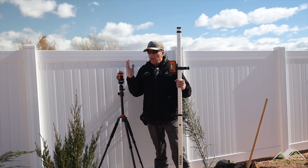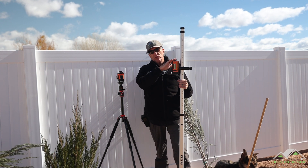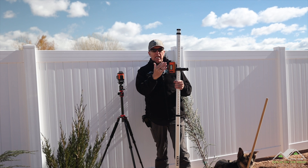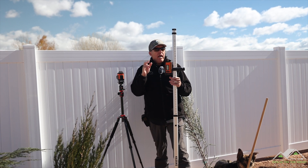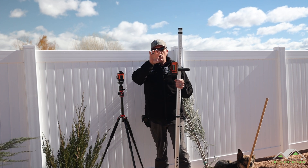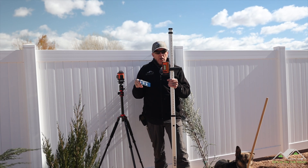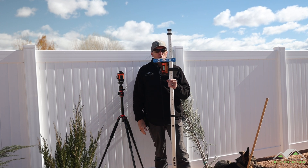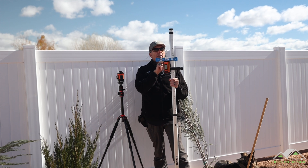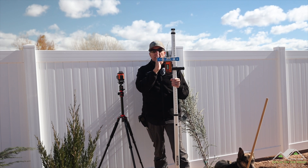It's not the optimal day for recording out here — it's pretty windy and really cold — but I have a wind attenuator on and we're getting nice sun, which is the best way to test the range on one of these receivers. They specifically asked me to do it on a sunny day so the max distance really reflects the capability of this receiver. Right on top of the unit are two little magnets for clicking it onto something metal, and you can also turn it horizontally for a horizontal laser line. It's also helpful to plop a torpedo level on it since there's only a tiny built-in level on the front, and I've noticed this unit does best when it is perfectly level or close to it.